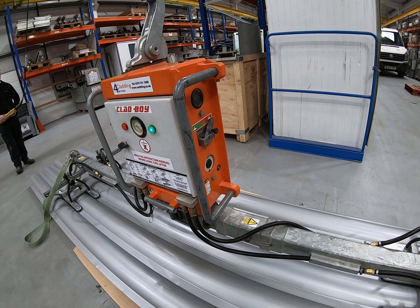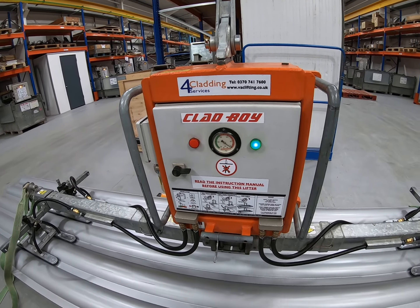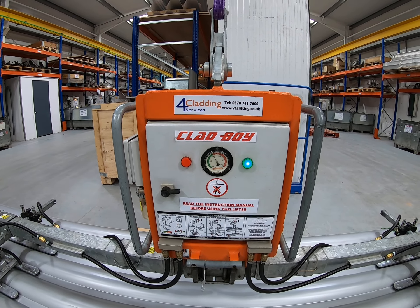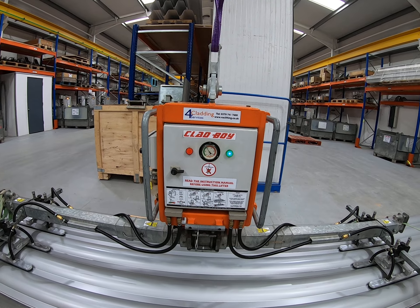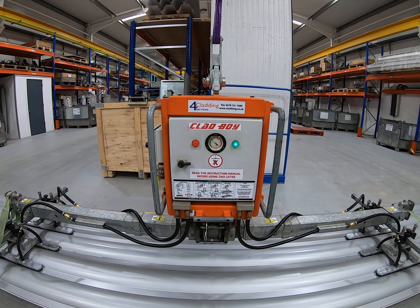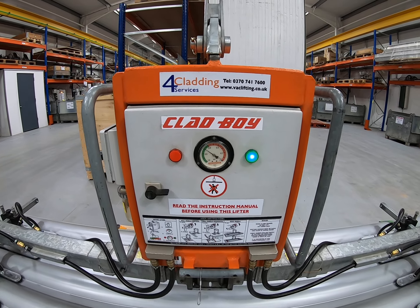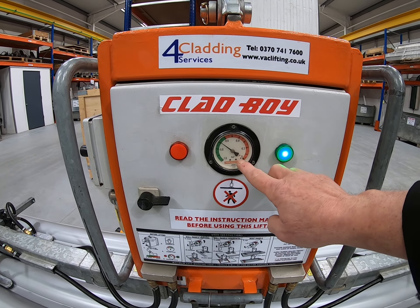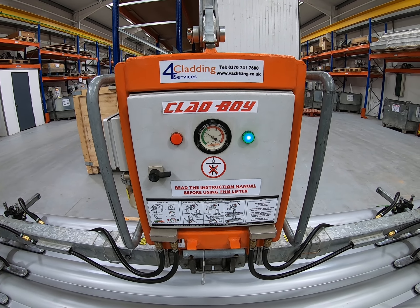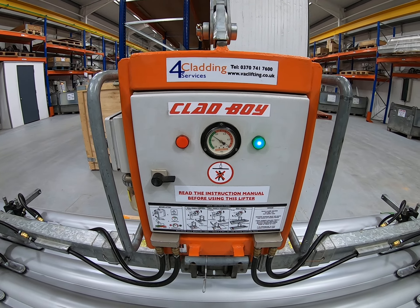I'm going to ask Neil again to slide the lever across into the suction zone so I can show you what happens on the front of the machine. As soon as Neil operated the lever, the vacuum gauge rose quickly through the red zone. While it was doing that, the red light was on and the acoustic warner was on. But as soon as the needle approached the green zone, the red light and the warner went off and the green light came on.